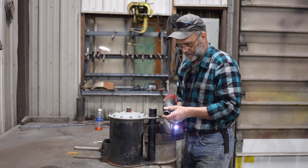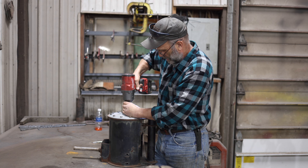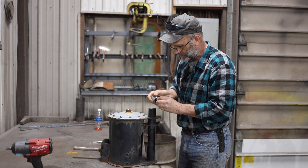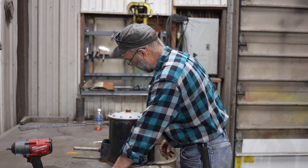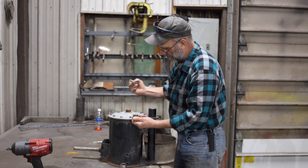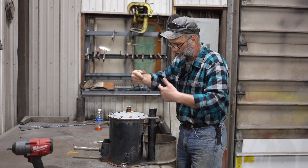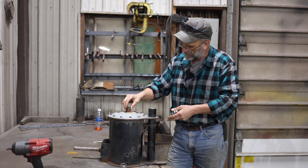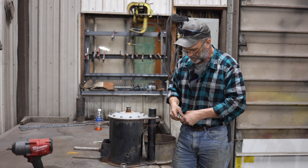You're going to need some simple tools. The torch I have over here — you're going to need a torch to cut the bearings off with. I've got to take the plate off the top. Now, there's two different styles of the single diaphragm. One has this check valve assembly on the top. The other, older style, has it underneath here.